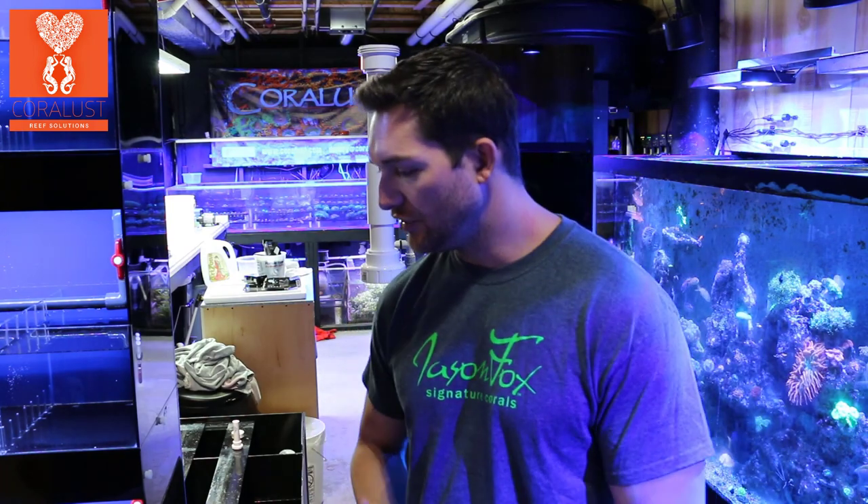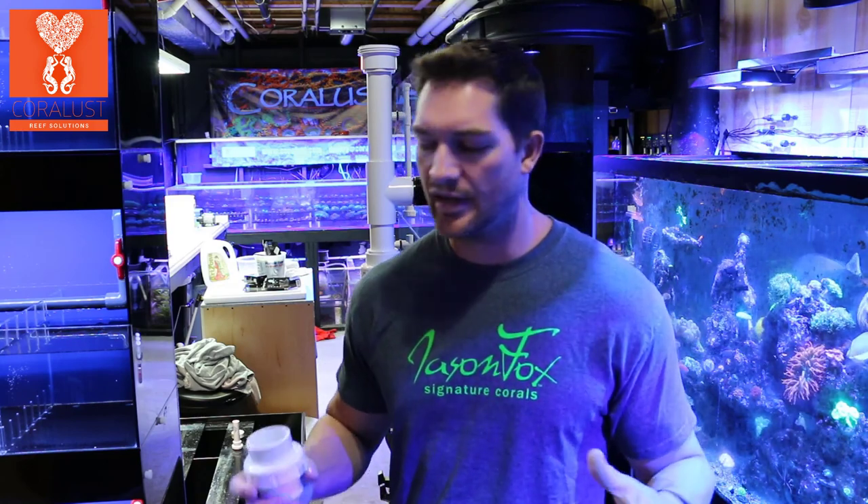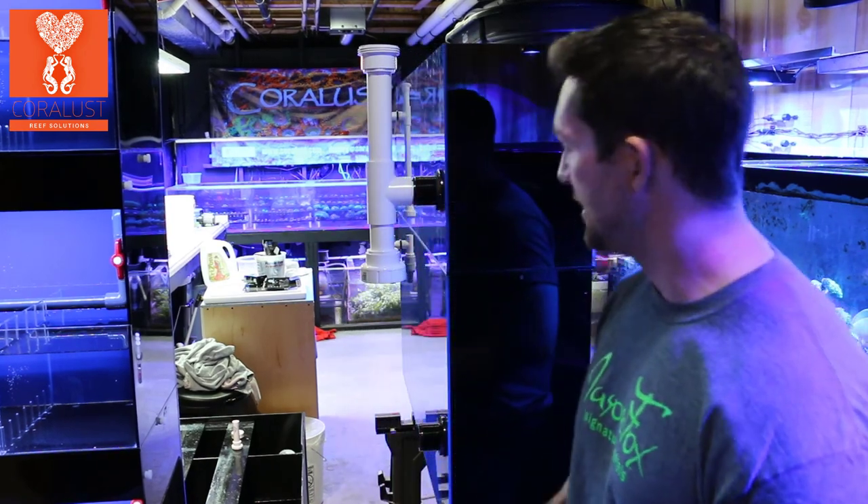Always check your parts. If you're using some old equipment and you're trying to replace it with something new, you go out and buy one of these unions or something and you realize the new threads don't match — the old threads are metric versus standard. That's a problem we always have to deal with. I just wanted to warn you guys: always check your stuff before you glue it.